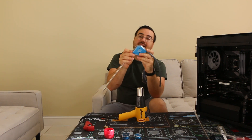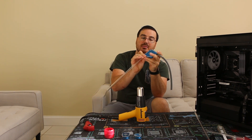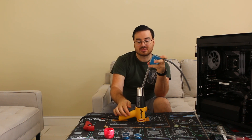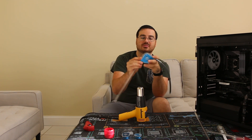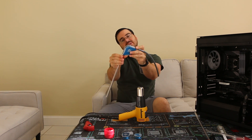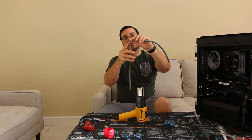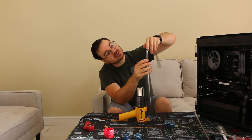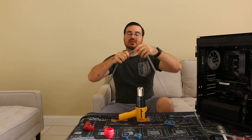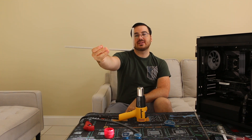This is why I recommend using PETG for beginners — it is much easier than using acrylic, and it's much quicker. And then we're going to loosen up on that, and there you go. That actually looks very good, I like it. Then you just pull it out, and there's a proper bend.